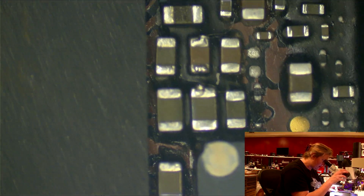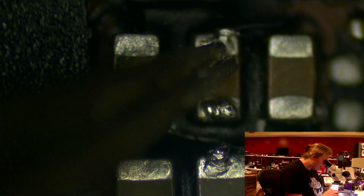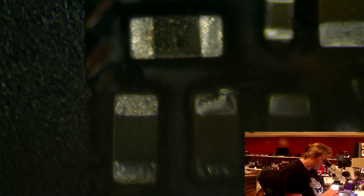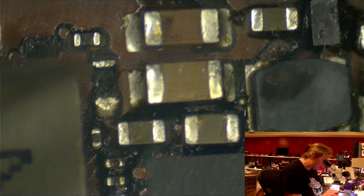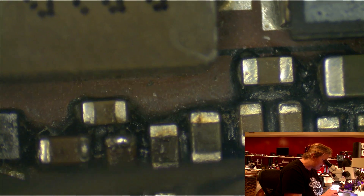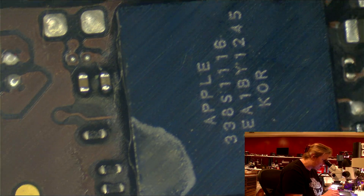If we look right here on these caps, we can see the solder blebbing up. This is what happens when quite a bit of heat is applied to the board — generally meaning there was too much heat in this area during some kind of repair, or during a situation where the board was shorting out, which caused quite a bit of heat. And if we look around, we can see other places around this chip where we see similar solder blebbing, especially at a distance from the power management chip. You can see a couple of places where there's heat on the board — right there and up on this capacitor as well.